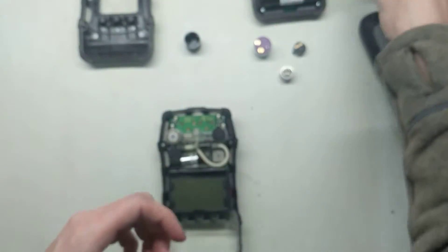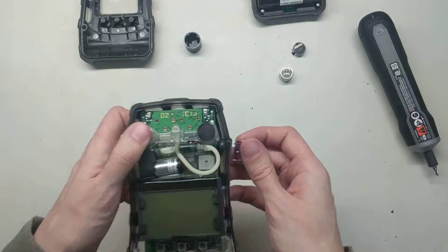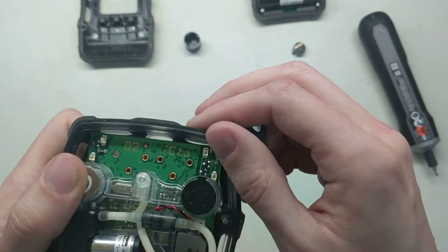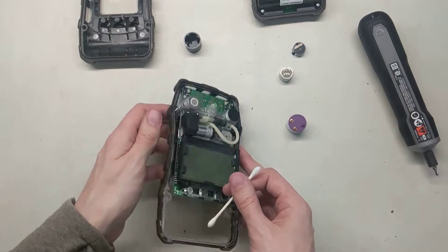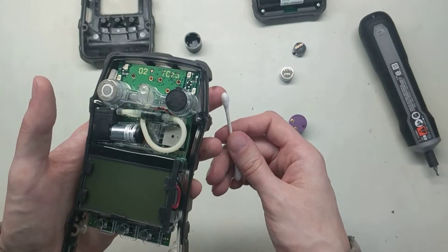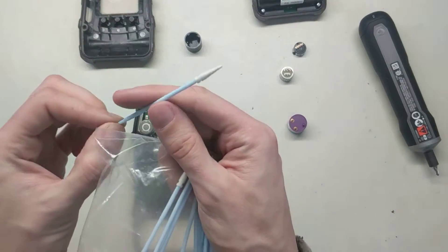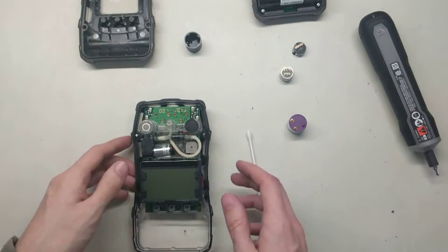We'll take that old one out and put it aside. Now we'll take our new sensor — this one has an 019 date code, so it's from January of 2019. Before installing, we want to check the board and make sure there's not a lot of corrosion or powdery residue built up, because that'll negatively impact our sensors. It looks decently clean, so this is pretty good to go. If it looks a little rough, take a foam-tip swab with a little methyl alcohol — you don't want fibers in there — and just wipe it off. That way it won't leave any residue behind on your board.